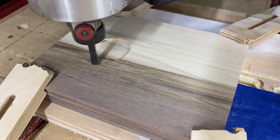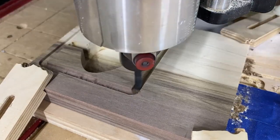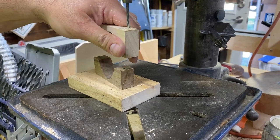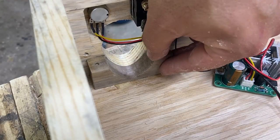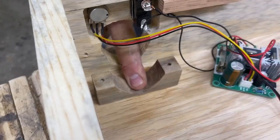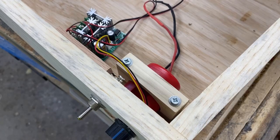I wanted this marble machine to stand out a little bit. I had one of these extra 12-volt Milwaukee battery packs and figured I'd try to incorporate that into the front of the machine. I created a couple of CNC files: one for the bracket that holds the adapter into the base, and another for the inside face of the marble machine that cuts a pocket and a couple of holes. The pocket is for the battery so you can plug it in from the front; the two holes are for your control knob and toggle switch. I cut down the adapter to remove the locking pieces on the side so the battery slides in and out from the front. Get your alignment right, put your bottom bracket down with CA glue, run a couple of screws through the bottom, add the top bracket, and you're ready to go.